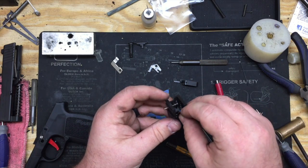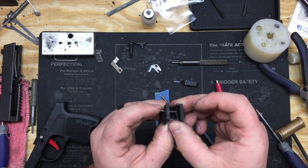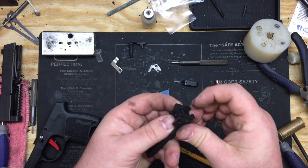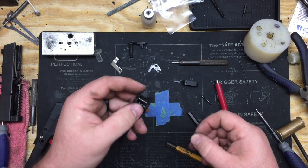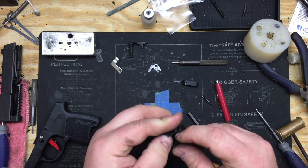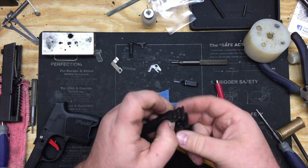We're going to take this. This is part of the hammer actuation. Pushes forward and whatnot. Make sure you line it up. And then go ahead and push that pin home. The spring's going to want to make it a little cockeyed from time to time. No big deal. Now, take your hammer pin, put it through the right side blocker, or actuator I should say, which is now wanting to give me fits.